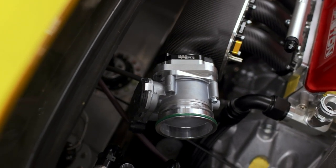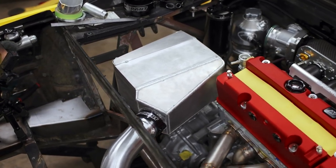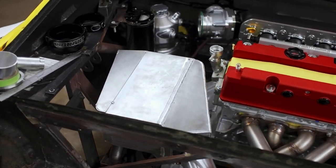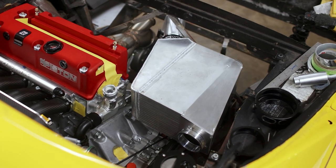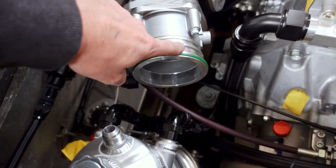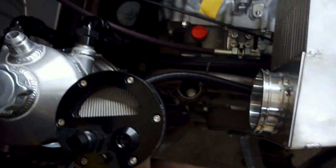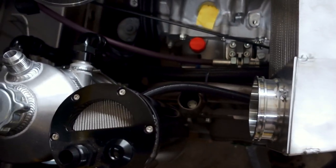I took the opportunity to put our intercooler into the engine bay sitting atop the mount we just made in order to get an idea of what needs to come next, because we do need to bridge the throttle body to that HD clamp ferrule that we put on the outlet of the intercooler. The only connection we have left is to go from the throttle body to this HD clamp here, but unfortunately it's not as simple a straight shot as it looks.